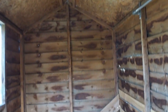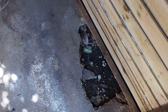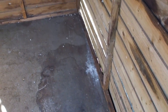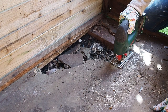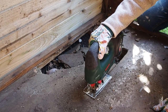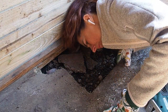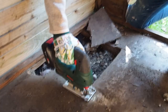Inside, the structure is fine — it stands up pretty well and the roof is fine — but the floor is one of the biggest things I need to deal with first. So one of the first things I did was cut out all the rotten wood in the floor using my jigsaw, avoiding any of the joists, and just tried to make the hole a little bit neater and get rid of any really rotten wood.